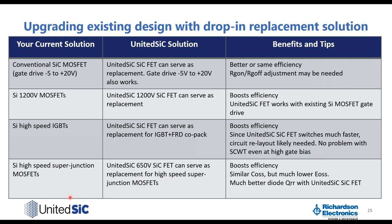If you are using a silicon high-speed IGBT, the United SiC silicon carbide FET can replace the IGBT plus FRD co-pack, boosting efficiency. Since the United SiC FET switches much faster, you may need to re-layout your circuit to reduce parasitics, but there will be no problem with short circuit capability even at high gate bias. If your current solution is a silicon-based high-speed superjunction MOSFET, the United SiC 650 V silicon carbide FET can serve as a replacement, with similar COSS but much lower EOSS and much better diode QRR — enabling CCM totem pole applications that superjunction MOSFETs cannot support.